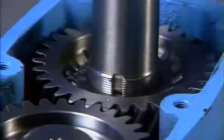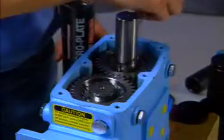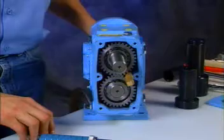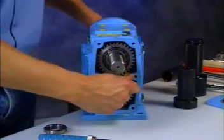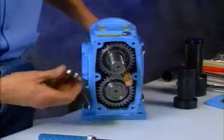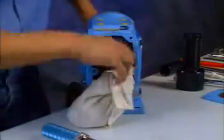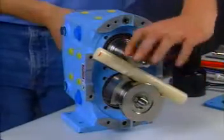Slip on the lock washers and apply microplate grease to the threaded area on the shafts and to the face of the lock nuts. When you're removing or torquing the lock nuts, you need to prevent the shaft from rotating, and here are 3 useful ways of doing it. With a wood or nylon block wedged between the gears, with a rag in the gears, or with a dowel or hardwood block in the rotors.